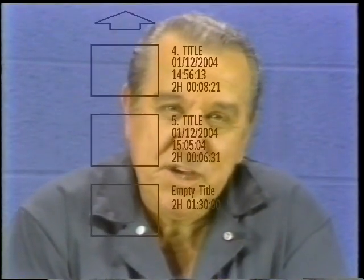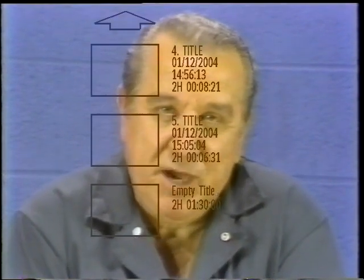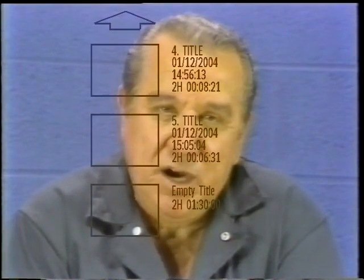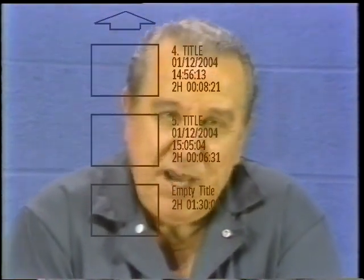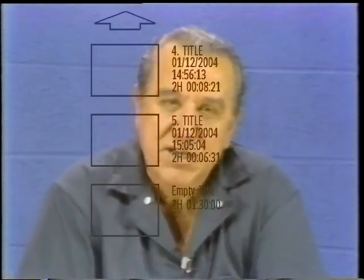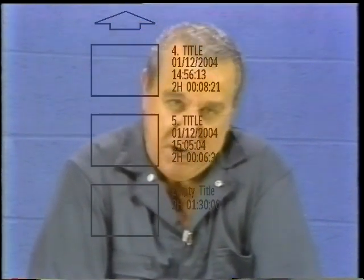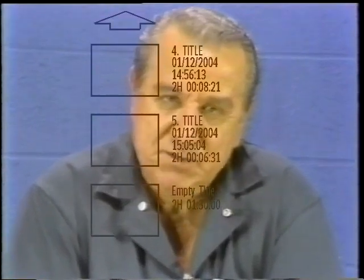With that, we've seen maintenance procedures for a typical tilting pad oil film thrust bearing. Both of the thrust bearings we've talked about so far are plain bearings, but anti-friction thrust bearings are also used. These can either be roller-type thrust bearings or ball-type thrust bearings. Maintenance procedures for anti-friction thrust bearings are essentially the same as for anti-friction journal bearings. We still need to talk about the lubrication of bearings. But before we get to that, review the reassembly of tilting pad oil film thrust bearings with your instructor.